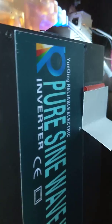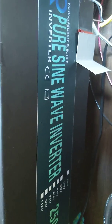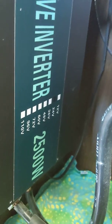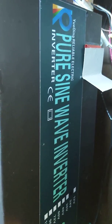So the voltage on the inverters to use these batteries is 24 volts. This company, Reliable Electric, is one of the more economical brands. They're pretty cheap. I only paid $230 for this 2500 watt continuous, 5000 watt surge, 24 volt inverter. If somebody does order from these guys on eBay, the Reliable Electric eBay store,